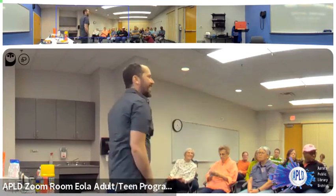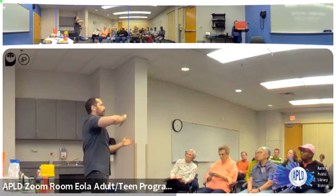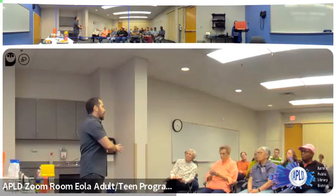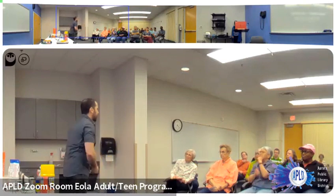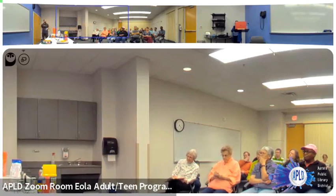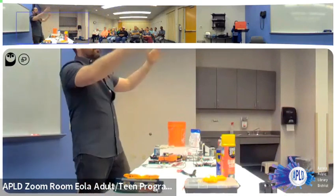Been there, done that. Yeah, you can absolutely, there are plenty of times when I've been working on a place, halfway done with the job, and you lose a lot of paint when you wash a roller, okay? You lose time by washing a roller that you're just going to get wet with the same paint again next time you're there. Put a little foil on so it doesn't make a mess, throw it in the freezer, head out, come back the next day, ready to rock. Okay, you do have to let it thaw. That can take a minute, all right? Questions?